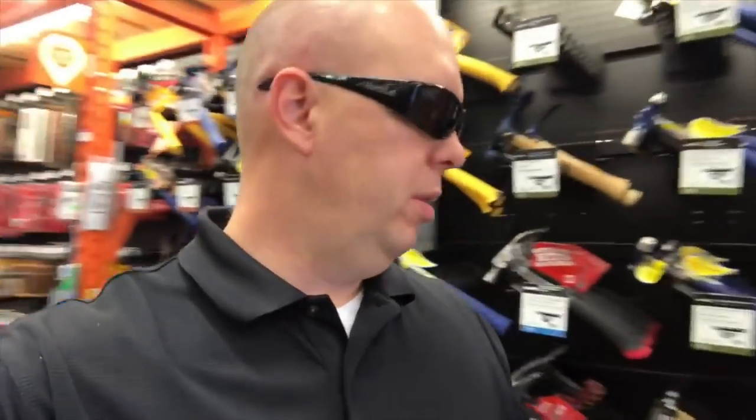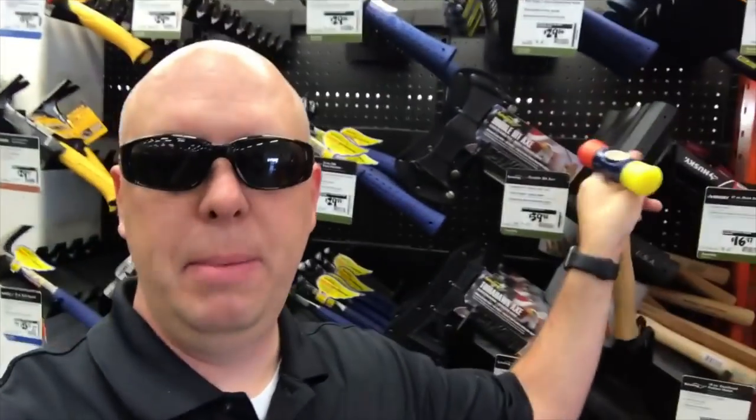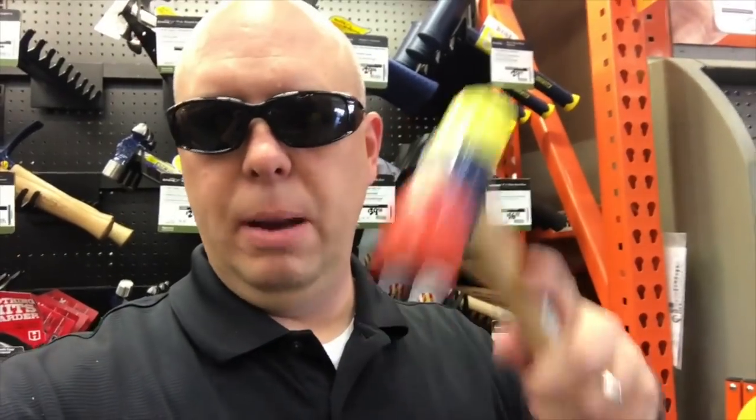Now that you have your tape, roofing nails, and wooden stakes, you'll need something to drive the stakes into the ground. There are a ton of hammers here. I like either a basic metal claw hammer or a hard plastic mallet. Rubber mallets tend to bounce. Something with a wider face for ten to fifteen bucks works well — the wide spot helps drive the stake down, and a hard metal claw hammer may actually split the wood, so the mallet is a bit better.